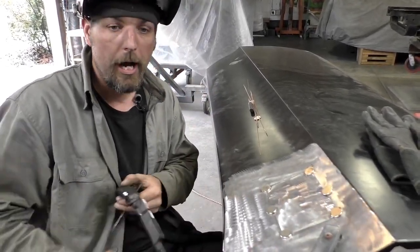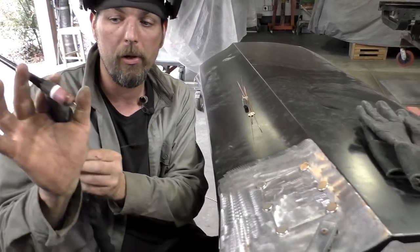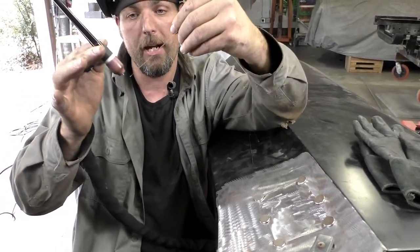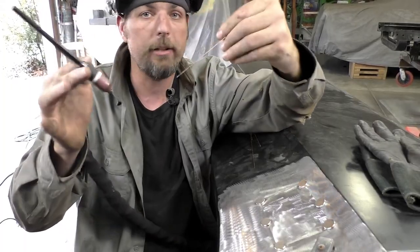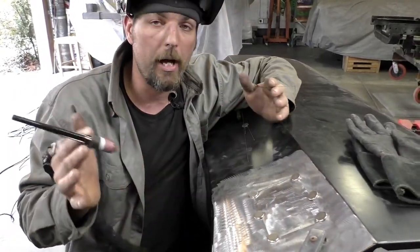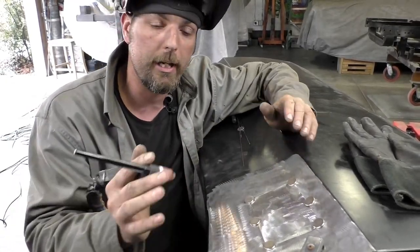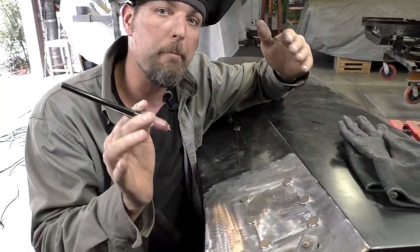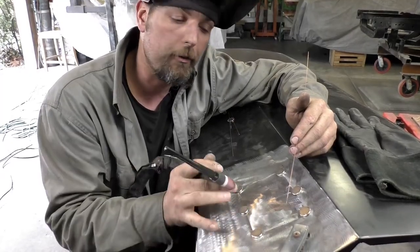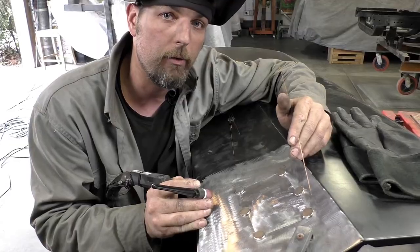We wiped everything down with acetone — filler rod, tungsten, everything. I have the cable draped over me so I'm not lifting the whole thing; get it where you have to hold as little cable as you can. Get comfortable. I like to hold my TIG torch with my hand up and kind of wrap it around it. The whole idea — you want your TIG torch and filler rod at a 90-degree angle at all times; you're feeding and walking at a comfortable position, always feeding forward. Right now we're not using gloves because I want to be able to feel the area to fine-tune it. We're going to build a puddle first and then dip the TIG rod in. We'll do a couple tacks, then put you in a time lapse and finish tacking, then get ready to weld.